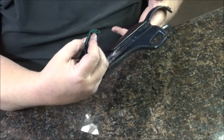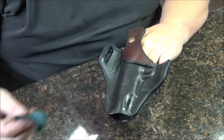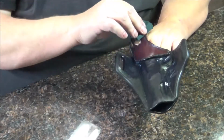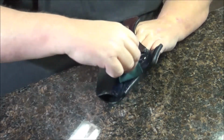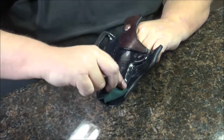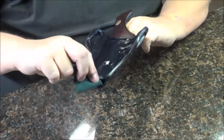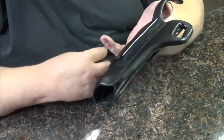Yeah, we're probably going to need 4 coats on this, I think, the way everything's going. It's just drying in there really quick. You want to try to, as much as you can, keep the bubbles out. And you're going to get some in there. And most of them are going to be fine. They're going to just pop when they dry and you'll never notice them. Every now and again, you'll get a bubble that'll stay and it's going to look ugly. It just happens that way.